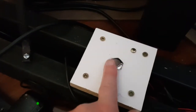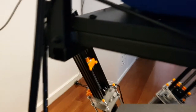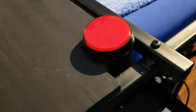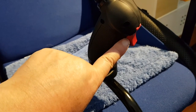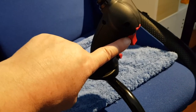The USB connection for the helicopter controls is taped to the side of the chair and drops down with the wires from the panic switch through a spiral plastic guide that keeps the wires together. There's a panic switch in easy reach, though typically I use the trigger control on the helicopter joystick. If something goes wrong or I'm about to crash, this pauses the simulator so I can reset it without having to get out of the chair and push the reset button for the self-latching relay.